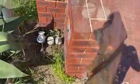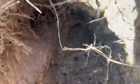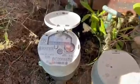I've dug a hole and everything is saturated in here. I found a reticulation valve, and I can hear it running and running. So let's isolate that and see if this meter stops ticking.